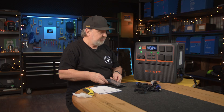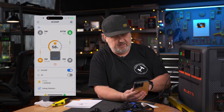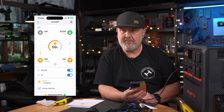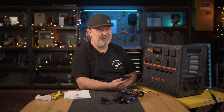I wonder what I'm going to plug in here — let's try and charge my phone. The app is showing me all the same things that are on the screen here. If I turn off the AC output — there we go — and then I can turn it back on again. The app is telling me it's charging at 820 watts at the moment, probably because the battery's a bit cold and it's not ramping up to full power yet. The battery management system is there to protect the battery from abuse, and that includes charging it when it's not warm enough. Lithium-ion batteries can discharge down to minus 20 degrees. This studio does get very cold overnight — here in subalpine Victoria we get down to about five degrees at nighttime, so it's probably just feeling a little chilly.